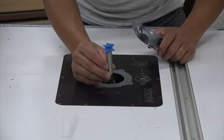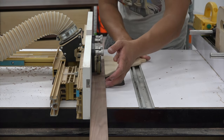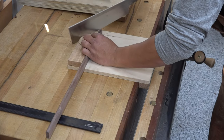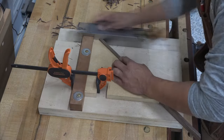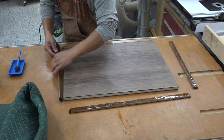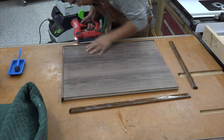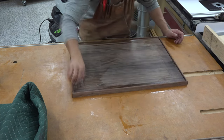The beading around the doors and drawer fronts is made using a three eighths inch beading bit chucked into the router table. Once the beading profile is machined I rip the beading on the table saw. I then mitered the beading using a 45 degree bench hook and a pull saw, and shot the ends of the miter using a 45 degree shooting board and miter plane. I used hide glue to attach the beading for its long open time while tacking up fairly quickly, and finally used pin nails to clamp the beading in place while the glue cures.